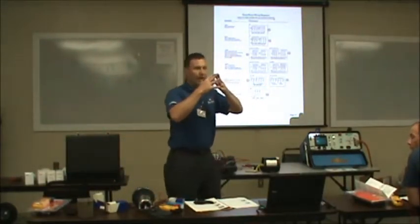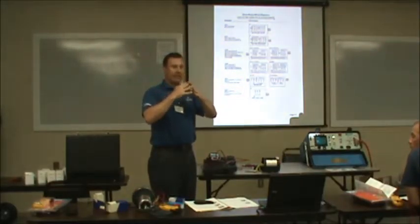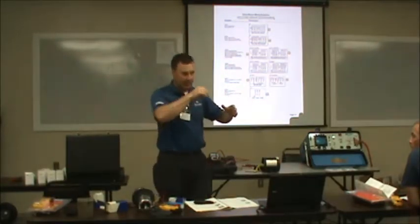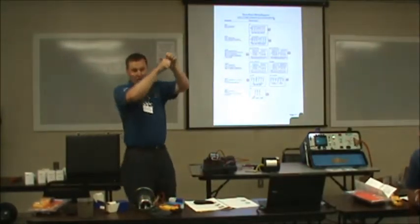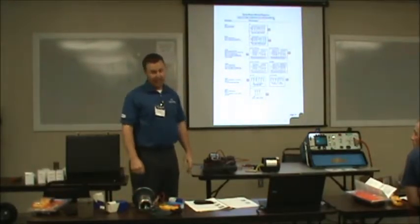Connections are everything. When you make a connection, make sure it's a sound connection. You put a wire nut on there, how many people use wire nuts? Everybody. Try to pull them out. If you can pull it out, it's not a good connection.